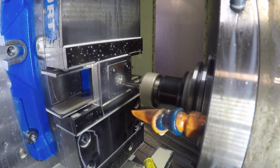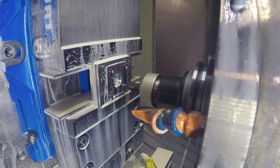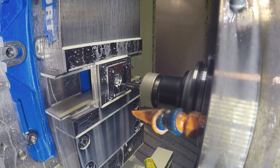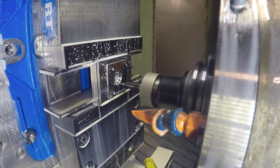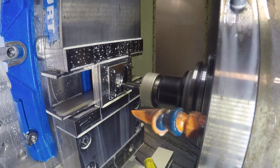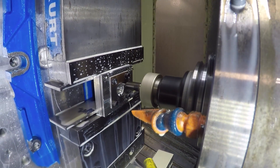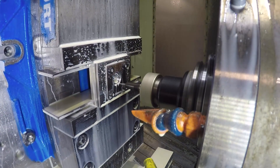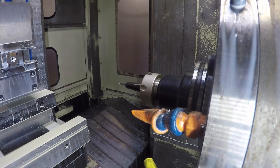This is also a new tool — it's a 3/64 end mill — which roughs out the little notches next to the tab in the middle of the bore. Those notches are a sixteenth of an inch wide so I had to use a 3/64 end mill to mill all this. This big mill only turns 6000 RPM so it's not really perfect for this little tiny end mill, but it does all right. I turned the coolant off here so you can kind of see what's happening — it's just roughing out those notches and finish-milling the bore and the tab.